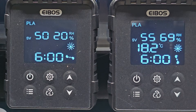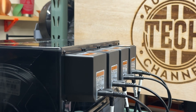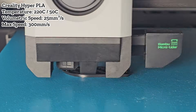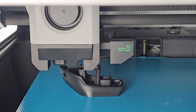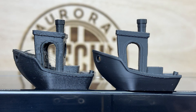I then dried both filaments for six hours. For PLA I used 50 degrees, and for PETG I used 55 degrees. The humidity inside the box was still relatively high, around 65 to 70%. I set the heating level to level 1, since we only needed to reach 50 and 55 degrees and did not require level 3. When the drying cycle started, two vents at the back opened automatically. After about 30 minutes, the temperature stabilized, and I let the six-hour cycle finish before reprinting the PLA benchy. This time, the PLA print looked like a normal benchy. There was some very minor stringing, but overall the print quality was decent and there was really not much to complain about. Compared with the previous print, the difference was huge.